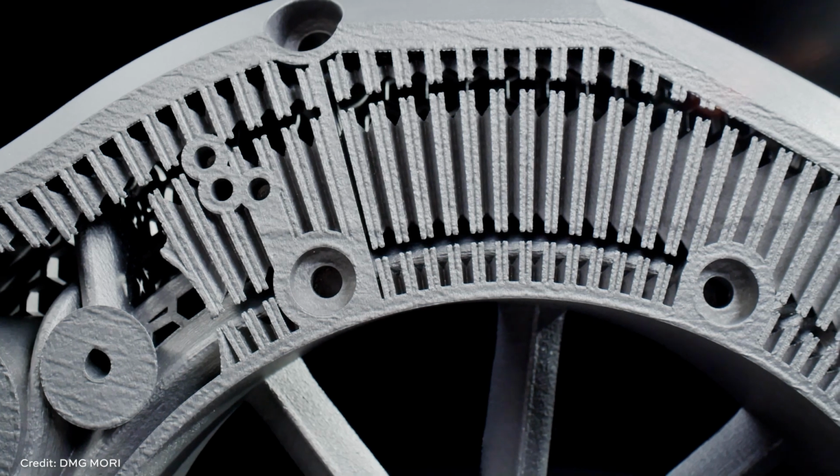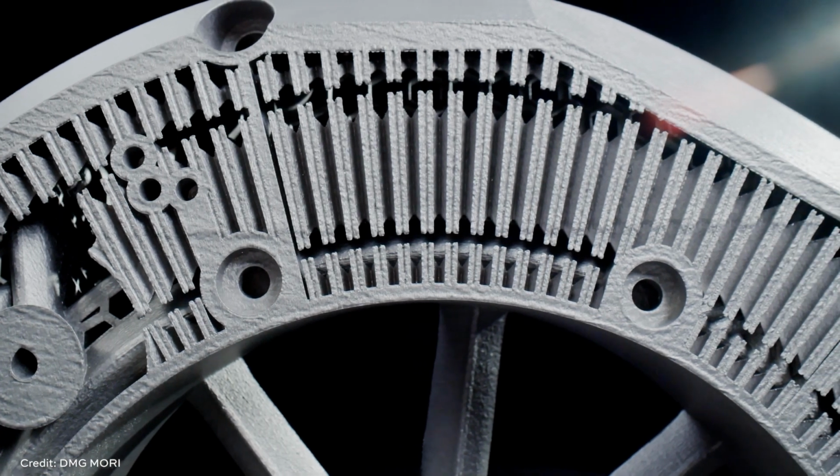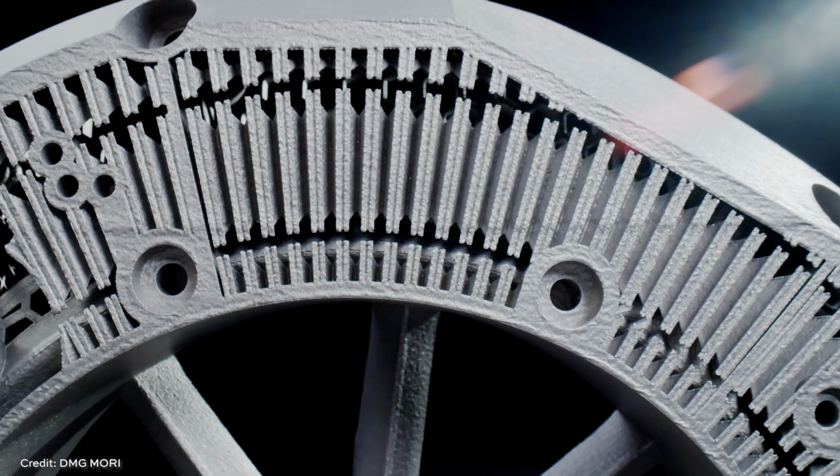You always should focus on the whole process. That is always important, what I see when I'm working with customers. We have a lot of customers from milling, or sometimes we have customers who are just in printing, but the process is so important. In the first step, in the development phase, you should have some ideas about how to clamp the part, how to get out the powder. You have seen this solid support we have designed and not created automatically with a work preparation software tool, just because we have the process in mind.